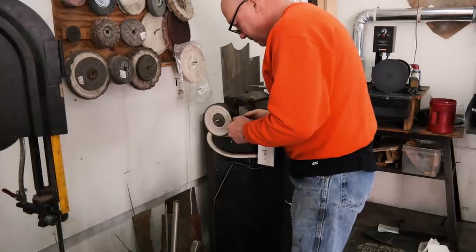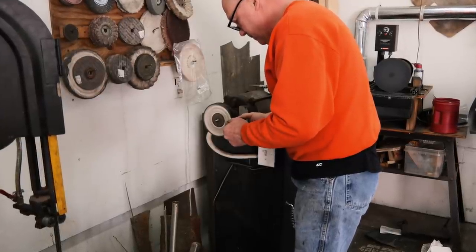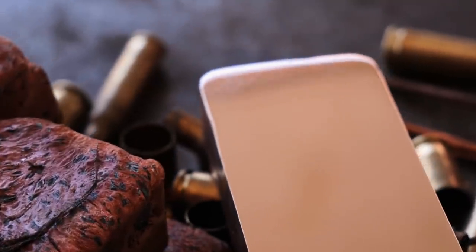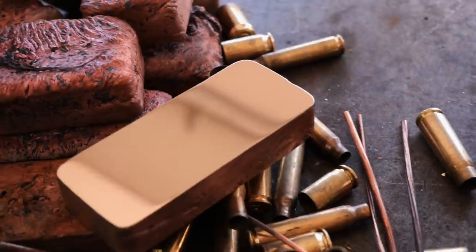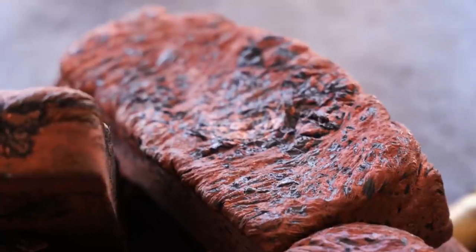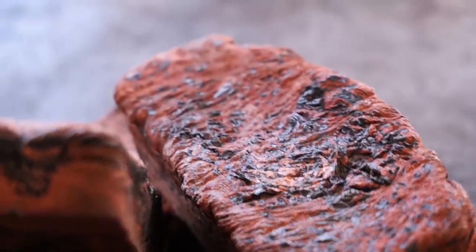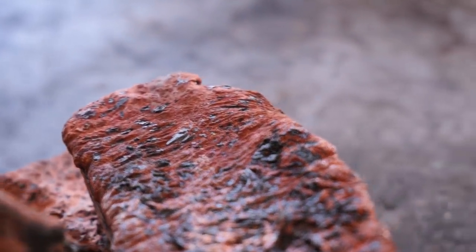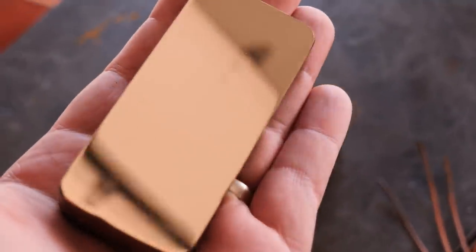I'm going to give them a little clean up and buff so I can check my color. After some trial and error mixing the copper and the brass together, I got the exact color that I was looking for and it's duplicatable. I kept track of my measurements so I can do it again in another casting session — maybe later this year or ten years from now. It's all recorded.